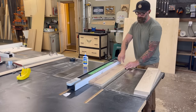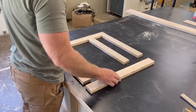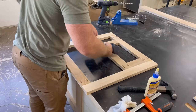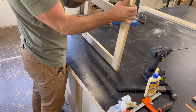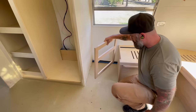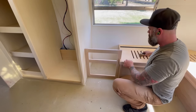Next I needed a face frame to span the gap along the front. Back in the shop, I milled down pieces of white oak and built a face frame that should perfectly fit between the bench and the fridge cabinet. I hooked it together the same way as all my face frames — with a little glue and pocket screws. Then came my favorite activity of all time: sanding. Craig was away, so yes, I did it myself. I carried the face frame into the Airstream to double-check the fit — a nice tight friction fit between the bench and fridge cabinet, just as planned.